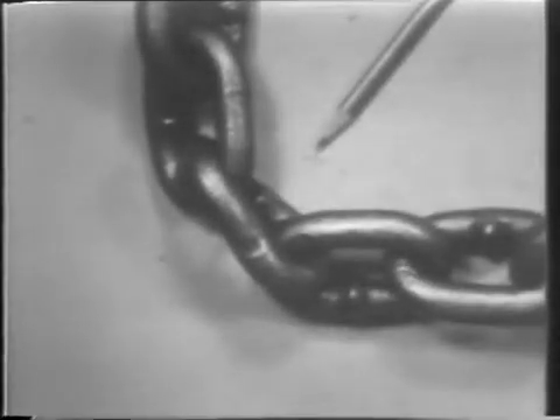Localized bending and shearing result from the chain length bearing against sharp corners. Stress concentration factors due to bearing against sharp corners make it advisable to subject chains in such service to more frequent inspection. Improper rigging will result in the premature wear of chain slings. Twists, knots or kinks in chain cause stresses which may result in failure of the chain even at some later date when a comparatively light load may be suspended with a proper hitch. We feel it is important to list a few fundamental do's and don'ts that should be adhered to in the proper use of chain slings.